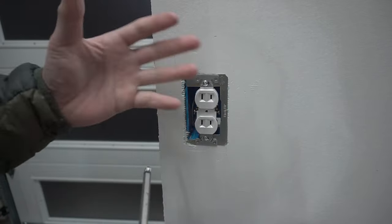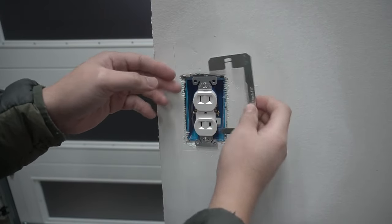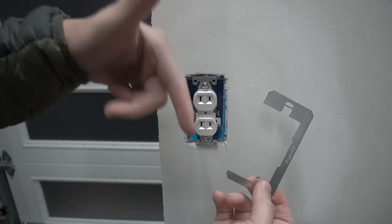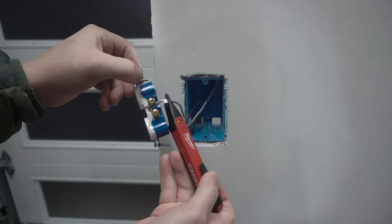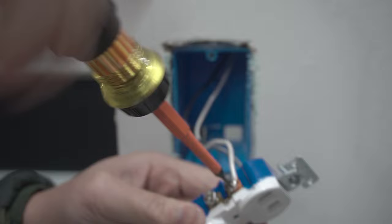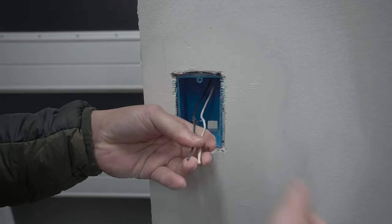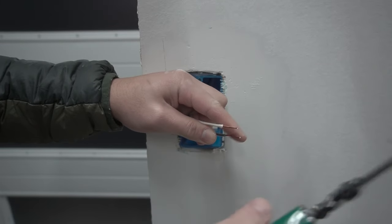Take out the cover. This is just a mock-up. If you have damaged drywall and the outlet sinks further into the box, then you have a sunken outlet — I actually made a video on that, I'll leave it in the description. Using this level plate — they're cheap — I highly suggest this tool. Make sure that you double-check for voltage. There is no voltage here. You can see that this only has a hot and neutral; there is no ground. I'm going to cut the wire ends off and make them into straight pieces. You can save those shepherd hooks — strip at least five-eighths. If you don't have that much wire to work with, you might have to reuse whatever wire or shepherd hook is left from the old receptacle.